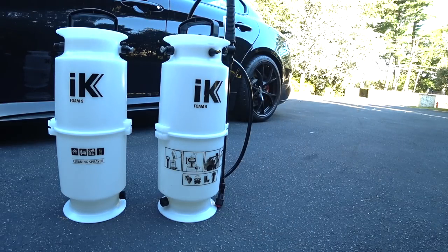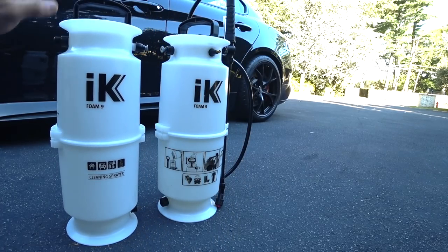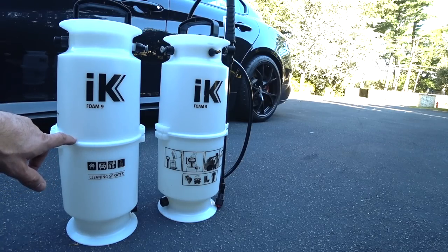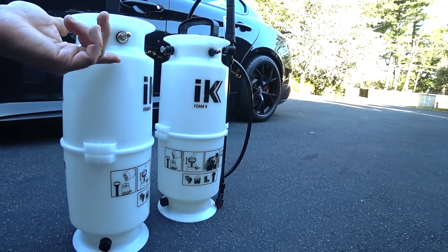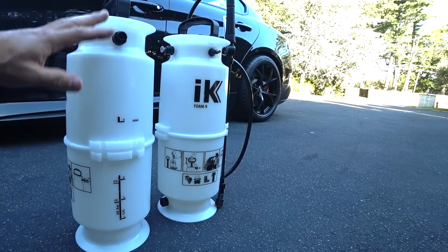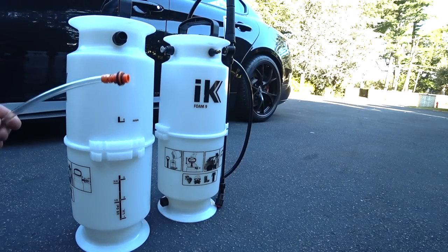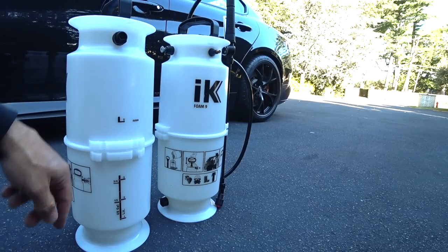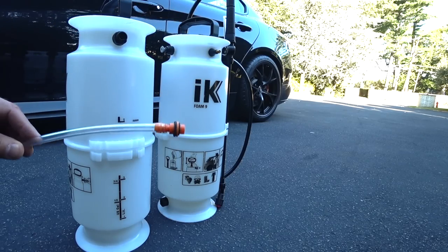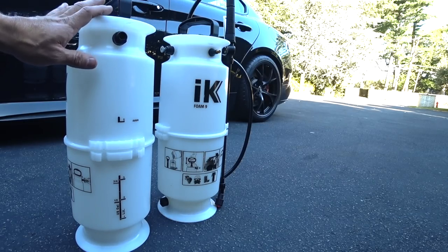The IK9 is a two-piece unit — the canister is bonded together with a glue seam. It has a pressure release valve but no pressure gauge, as those are too expensive to include. To change the foam density, you have to fully discharge the unit, unscrew the cap, and swap different colored pickup tubes inside. The pickup tube goes through the barrel all the way to the bottom. On most professional units from Germany and Italy, you change foam density at the tip without depressurizing — a totally different, more professional system.